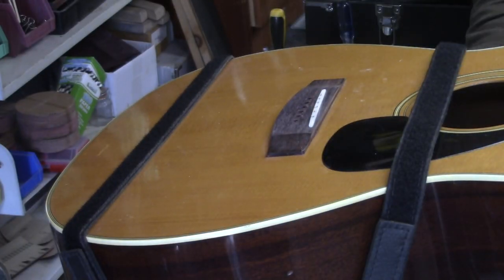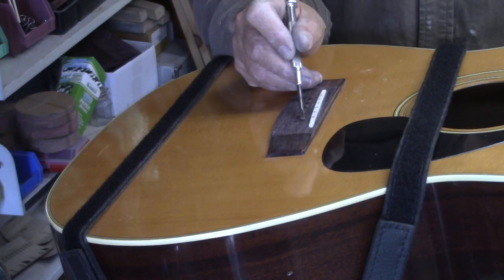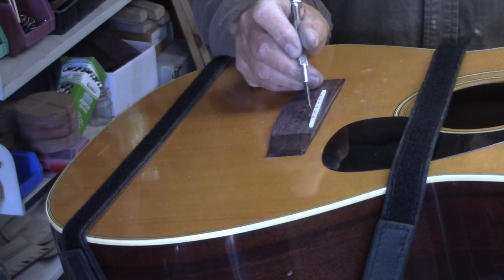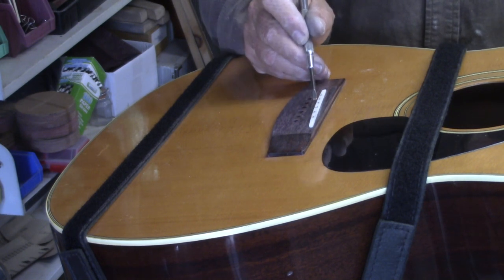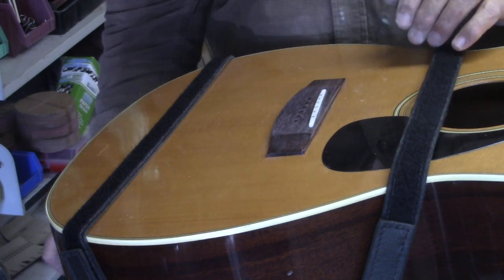Our action height is very presentable now. Across these peg holes I'll make relief cuts to make sure the string is resting firmly on the focal point of the saddle all the way across. We'll do that first before we do anything more on the saddle.